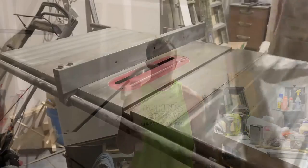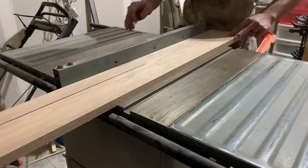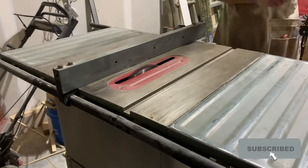For today's video we're gonna be making a checkerboard, working with a couple different types of wood. You want to get that dark and light combination, so we're going with some rich mahogany and a little wood I like to call aspen. The first thing we're gonna do is rip our stock down to about two inches wide. According to the internet, a standard checkerboard is made up of 64 two-by-two-inch squares.